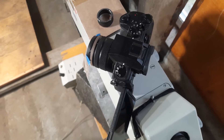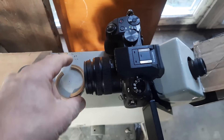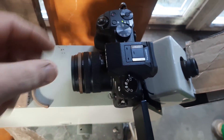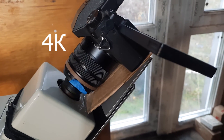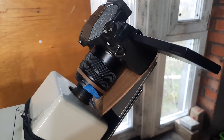Tiny movements of the lens or sensor are unacceptable here. But in the end, I achieved a pretty good result. Under certain conditions, the camera can see better than our naked eye. Through the camera, in 4K resolution and with maximum zoom, I was able to monitor the autocollimator's readings twice as accurately as with the naked eye.